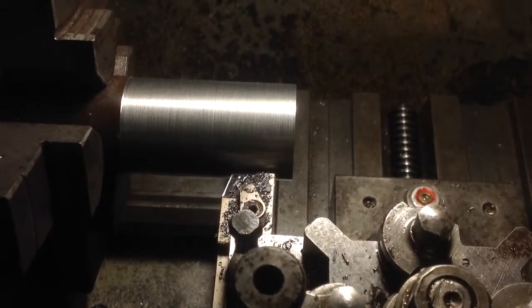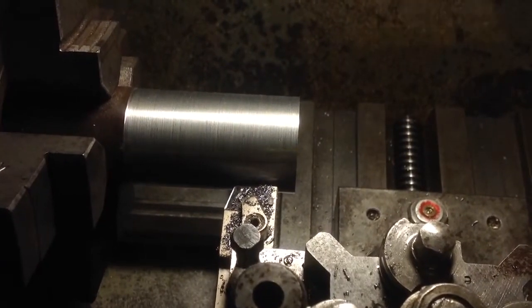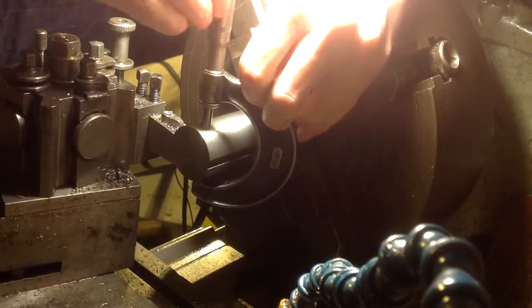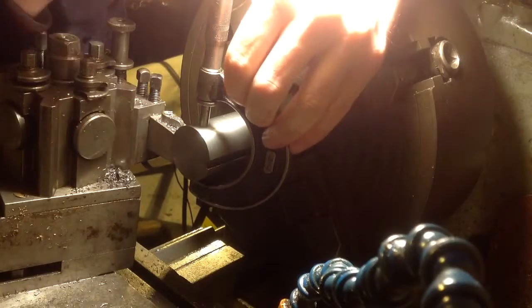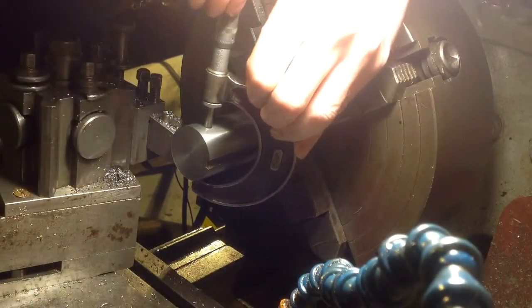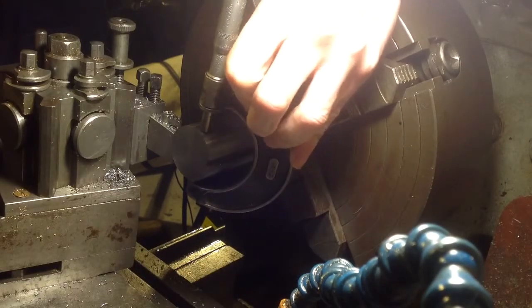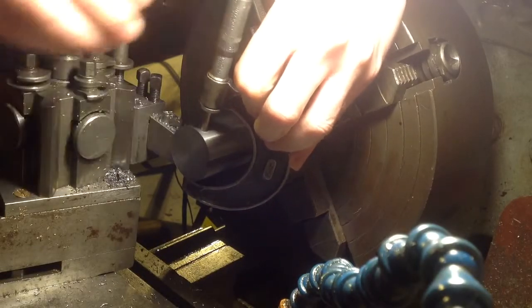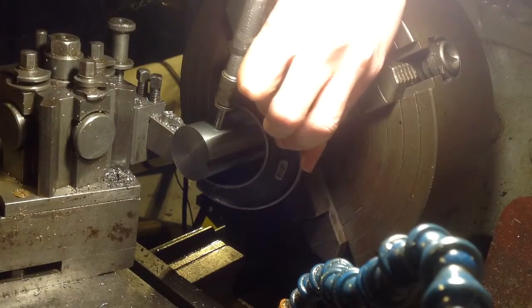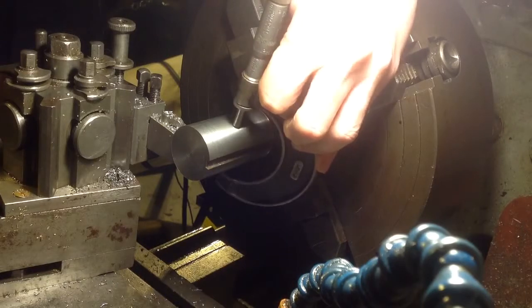If it does, it might be a simple fix. I'm going to get my mics out and just have a little look at that. I think we are looking at a problem with the gap. Let's use it like a no-go gauge — set it on there loosely. It goes there, it goes there, it goes there. That's where the tool is now. It doesn't go there. This is not a taper. It's a step.